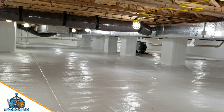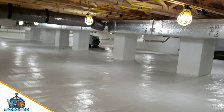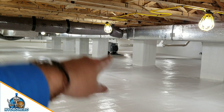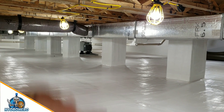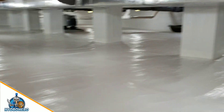Afterwards, we installed our HydroSeal vapor barrier. We closed off all the vents. We installed our AprilAire 1850 dehumidifier with a Clearview condensate pump that is self-cleaning. So relative humidity is really good.